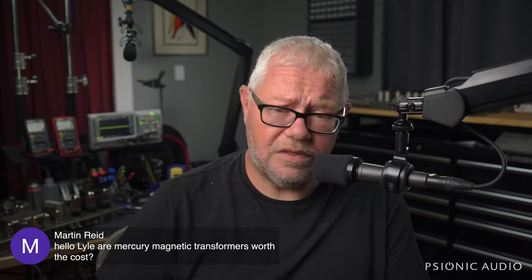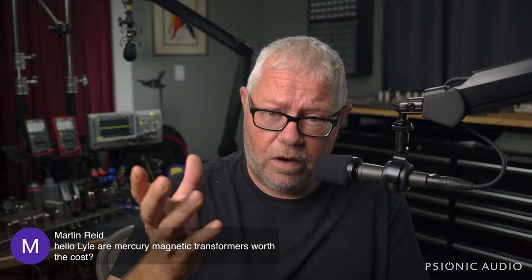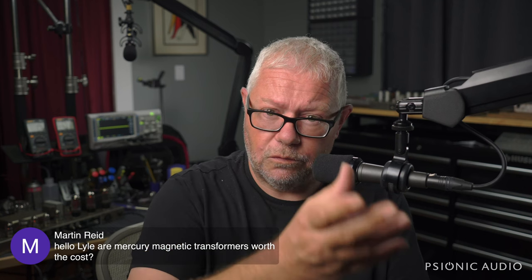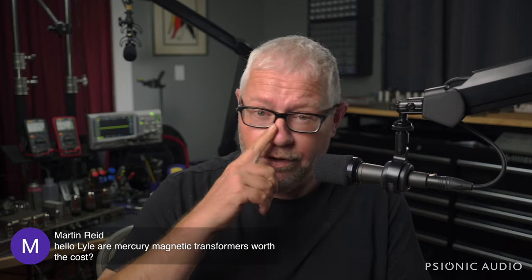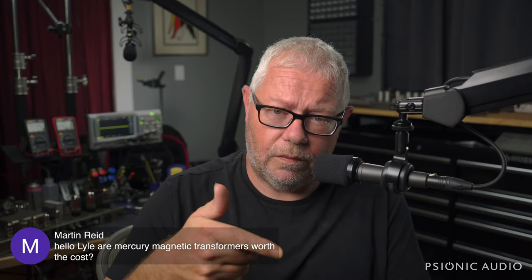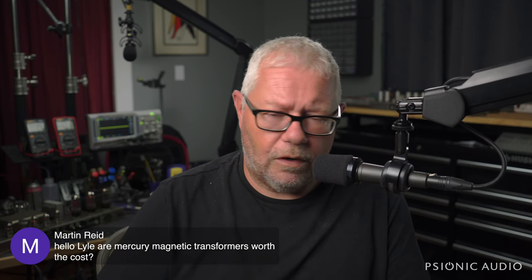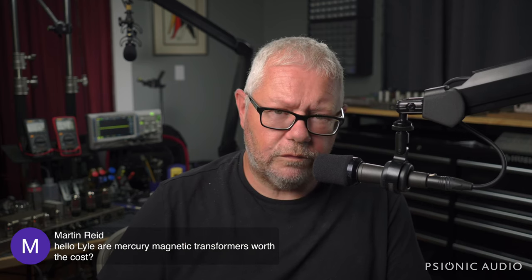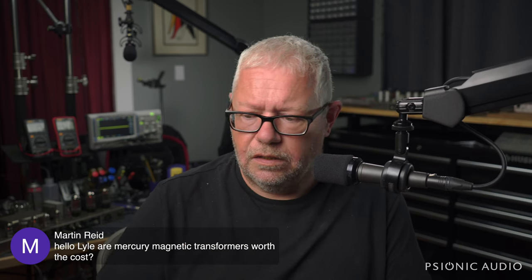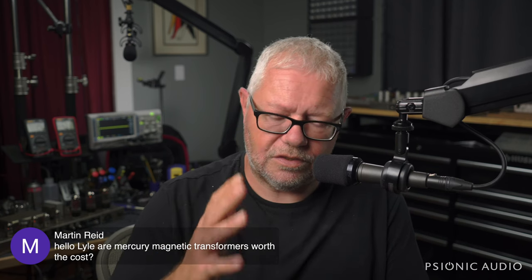A lot of companies, if you have a Marshall 50-watt, they sell a 50-watt output transformer and they sell a 100-watt output transformer. That's what they offer. With Mercury, I can say, hey, I want one like they did in '67, but this other guy has one that I want more of the '69 thing. There are differences in how they were wound, and they've reproduced a lot of different things. So it's not just a 50-watt Marshall, it's a 50-watt Marshall and X.